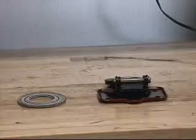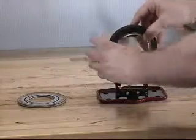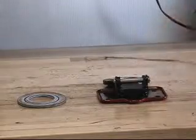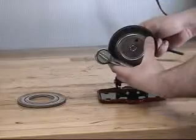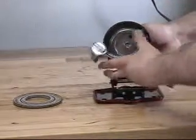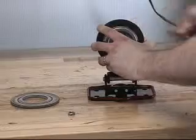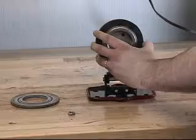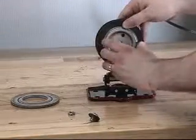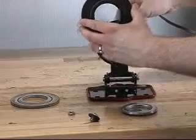To replace the clapper rubber, you will need to remove the rubber retaining ring from the clapper to free the clapper rubber. Do this by removing the jam nut from the clapper rubber. With the jam nut now removed, the screw and sealing washer can be removed from the clapper assembly. This will allow the rubber retainer and the clapper rubber to be removed.